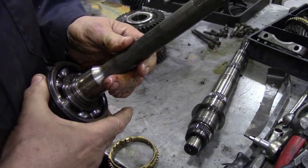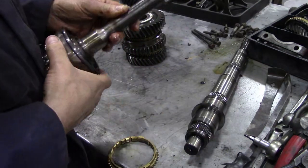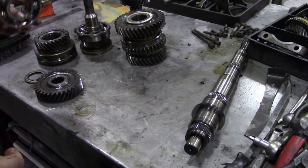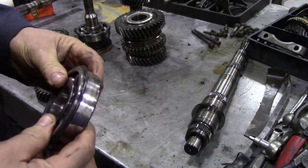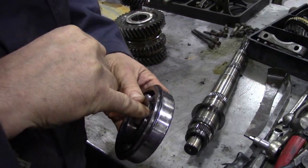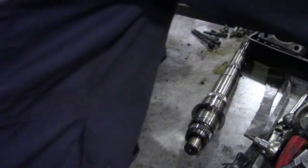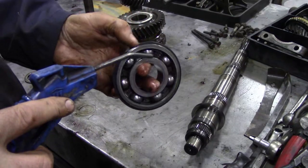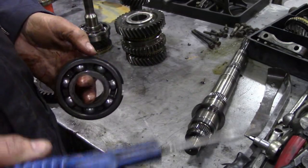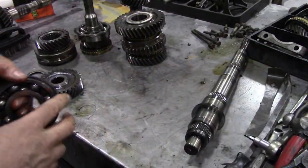The bearings are roller bearings and ball bearings. There's always a little bit of play once they get slightly worn. I'm not going to replace them — sometimes people go wild and change absolutely everything, but if you check them out and listen to them they're going to be fine. Look inside the races for any chips on both sides, inside and out. Never wash them off and spin them with an air gun — being dry it can damage the inside of the races, so don't do it.